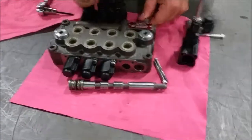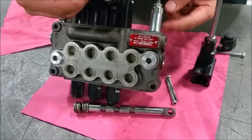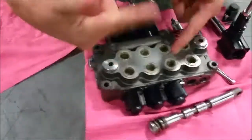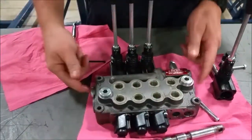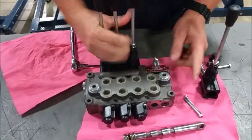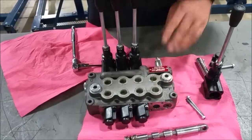This has a pressure relief valve on the end of it. Fluid goes in through one side and out the other — all the ports work with hydraulic fluid. As pressure builds, the pressure relief valve relieves pressure through the system so you can't over-pressurize the system.